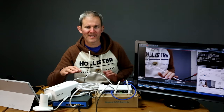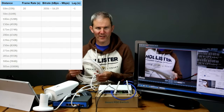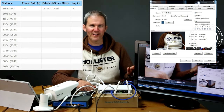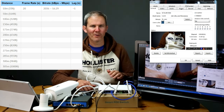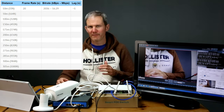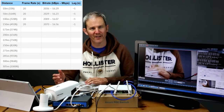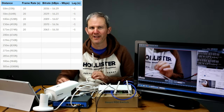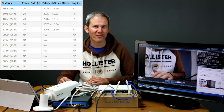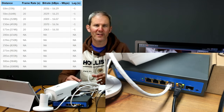Now let's see how well the switch performed at the same distances connected to an IP camera requiring PoE. I looked at the switch's ability to power the camera, ping latency, bit rate, and any lag. At 10 meters or 33 feet, the camera powered on, I could ping it at less than one millisecond, the bit rate was 2036 kilobytes per second, and video quality was perfect with about one second of lag. Results at 50 meters or 164 feet were quite similar, and the same for 100 meters or 328 feet. Beyond this, at 150 meters or 492 feet and at 175 meters or 574 feet, I was still able to see footage on my PC with little to no lag — very impressive. Once I hit 200 meters or 656 feet and beyond, there was no data activity. The cameras powered on all the way up to 1000 feet, but there was no data link visible.